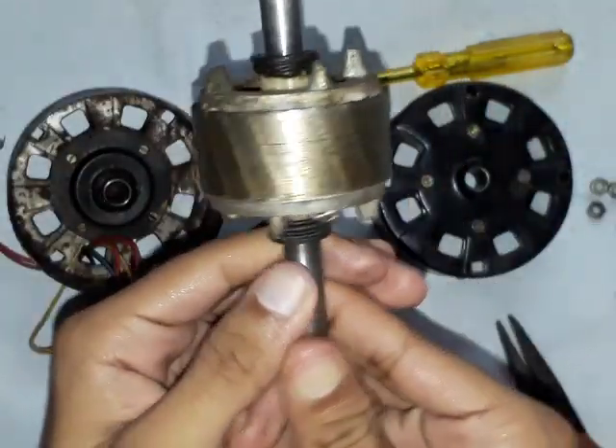So let's see the stator. See here, these are the stator teeth and slots — teeth and slots — where windings have been placed. The construction is very well constructed. The top one is the yoke, which is where the frame is attached. These are the soft iron cores, created by laminating the sheets. The laminations have been done for the reduction of eddy current losses.